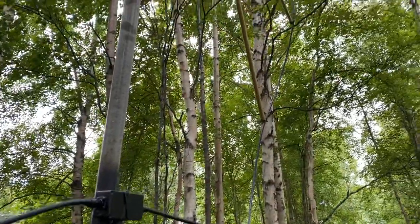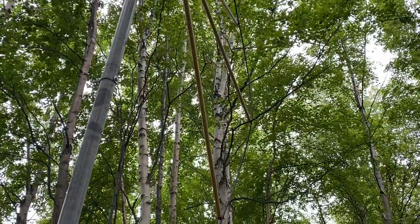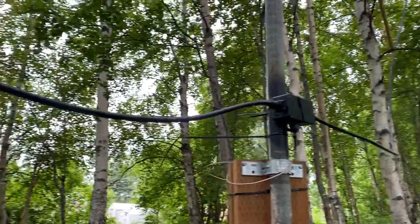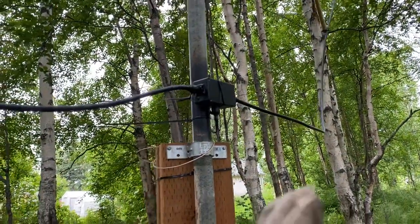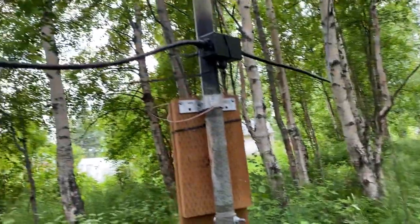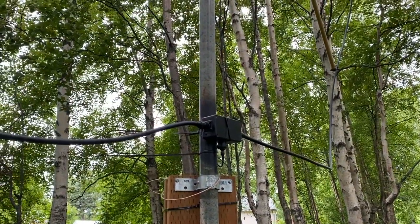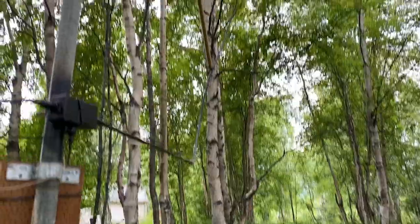What we're actually going to do is null one of the NDBs — non-directional beacons — one down in Homer, Alaska, down on the coast in Kachemak Bay. The other one is ALJ on 233 kilohertz, off Hinchinbrook Island, a couple of hundred miles away. We're looking for nice stable ground wave signals. We'll actually null the signal completely on one of these, and we'll look for signals suddenly appearing out of nowhere when the antennas are in the null situation — so we're actually receiving a reflection from a meteor trail which is off the null point. Well, that's the theory. We've been doing this now for nearly a year and a few meteor showers, but nothing has worked yet.